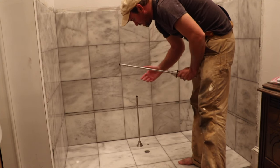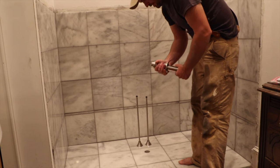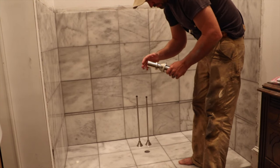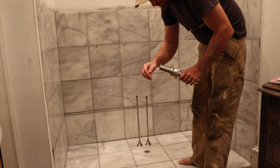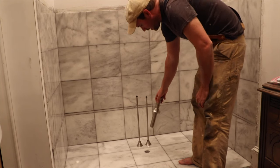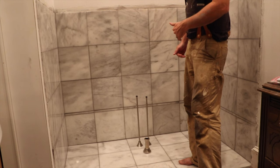It pretty much just will slide into place. And there's a floor flange, obviously. For my drain, I have a nice stainless steel pipe with a nut. There's a seal that goes in here, but that seal actually sits on the top and it will seal as this goes in. So this is correct. It's just a nut and another floor flange. And we'll slide that into place. That's all I have to do there. Everything else I'm going to do underneath the house in the crawl space.